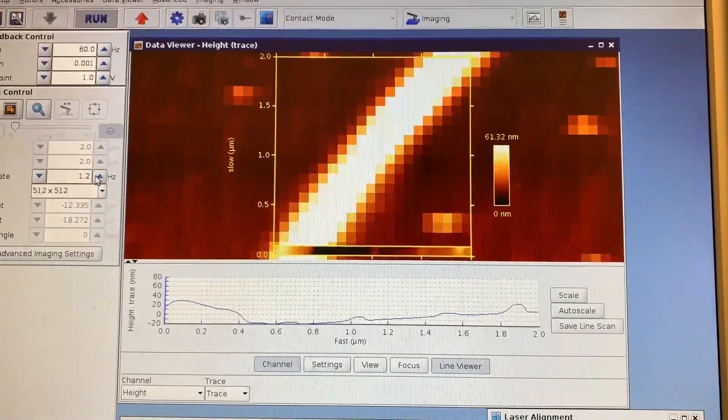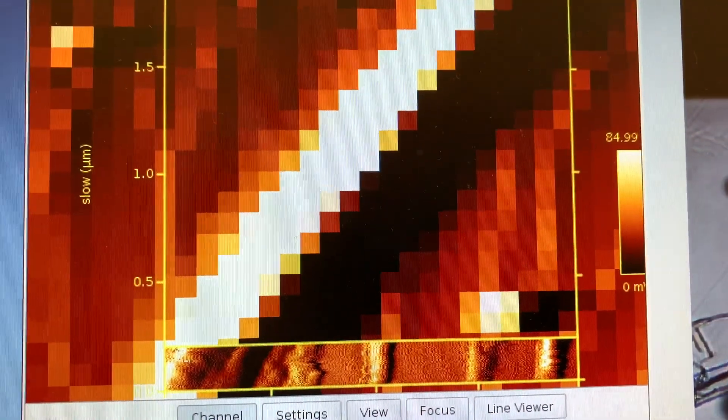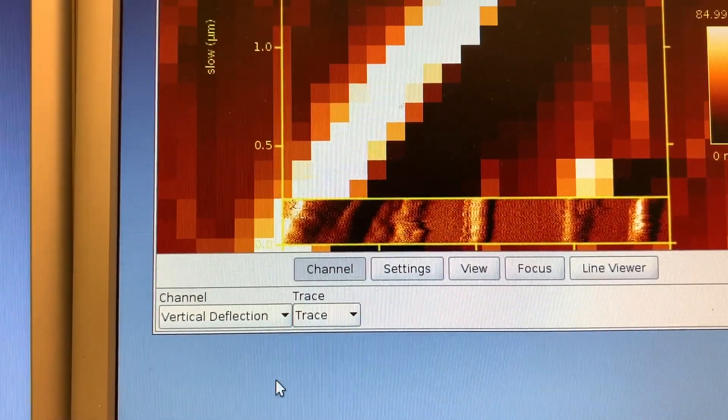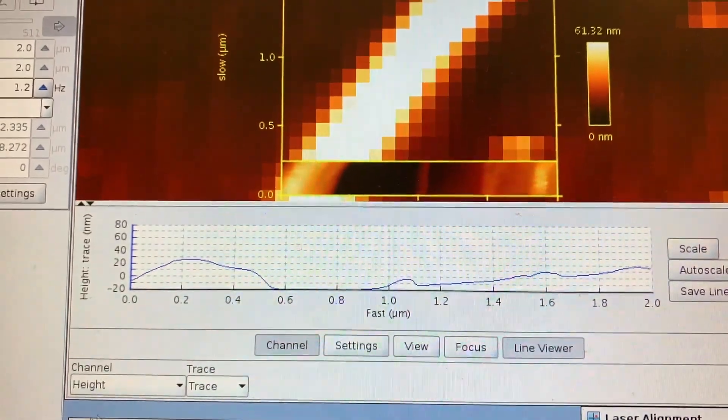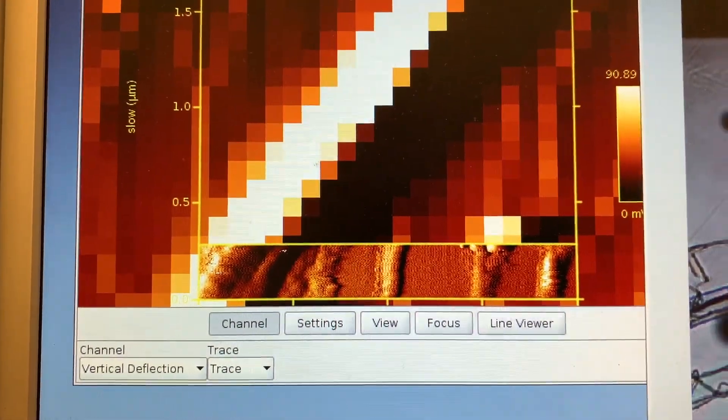You may also want to look out for material from the surface adding to the tip and changing its geometry. In the worst case, your AFM tip could become larger, lowering the overall obtainable detail in your images. There are plenty of other potential artifacts to watch out for, but as this is an introduction to AFM, we'll leave this discussion for another time, or maybe another video.